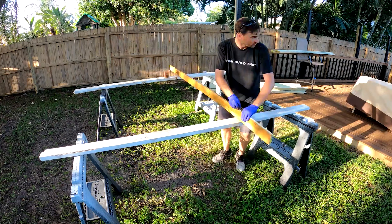To get the proper spacing, grab those spacer blocks and set one underneath the first row, then tap down one side until it touches the spacer block and make sure your left-to-right position is exactly where you want it. The posts for this were spaced so that the eight-foot-long boards land in the middle of the post so that your next row can butt up against it — you'll see later in the video how that's done.